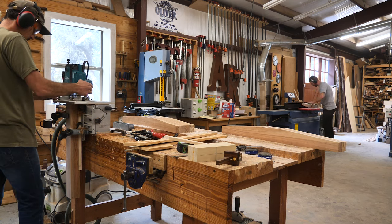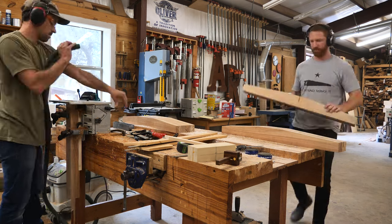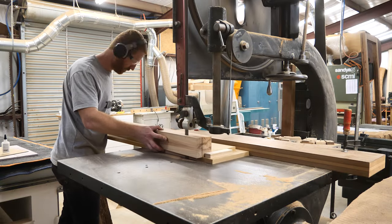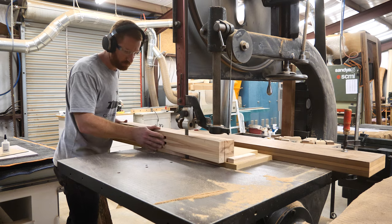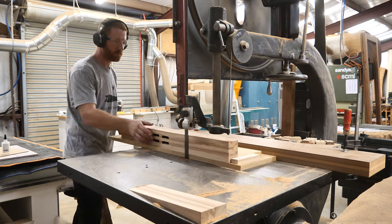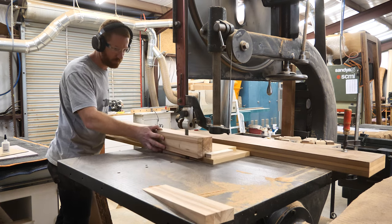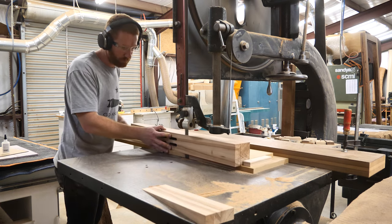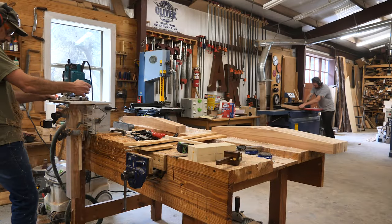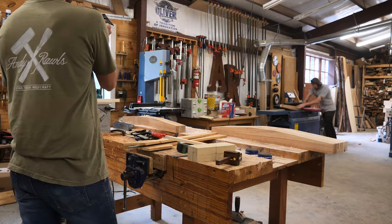I got a new Makita plunge router — it's amazing. It has a soft stop on it, like a brake that just shuts it off when you turn it off, which is a really cool feature. Robert and I are both really enjoying it. Here you can see Robert set up a jig — while I'm working on this joinery, he is cutting out tapers on the feet and supports. You can see the mortises there, that's where those tenons are going to go. He's going to cut them out on the bandsaw and then do one single pass on the jointer to clean up the bandsaw marks, then off to the sander.